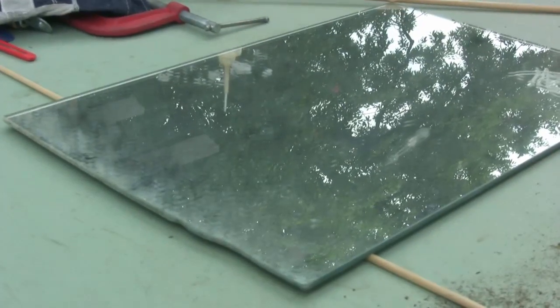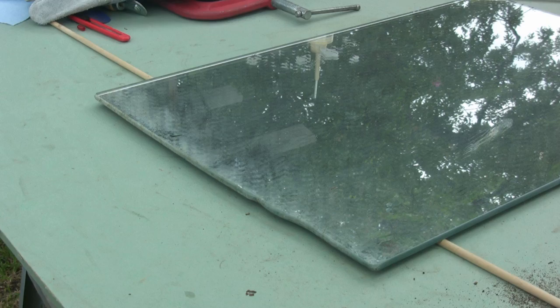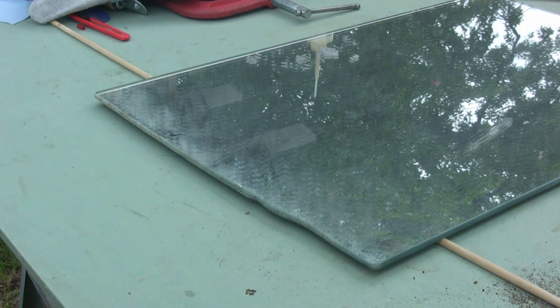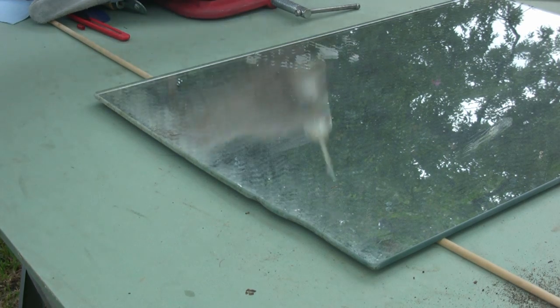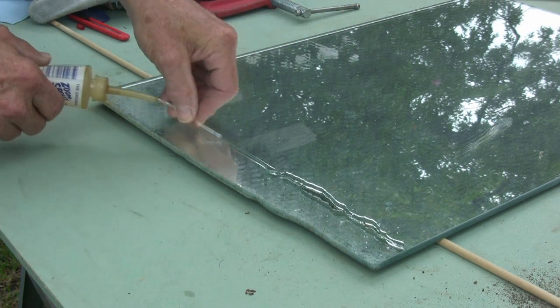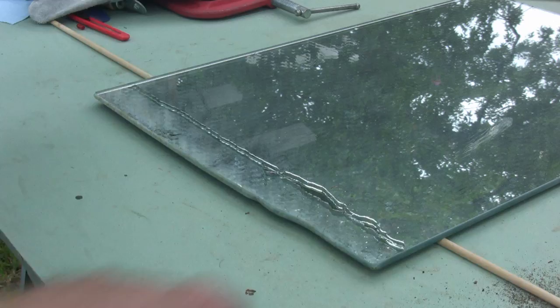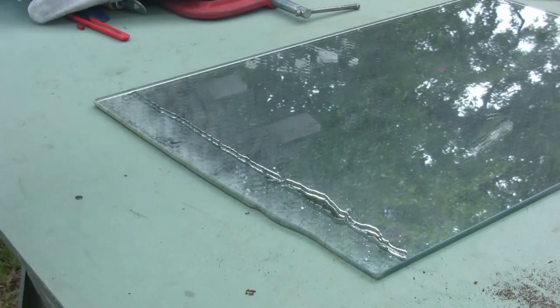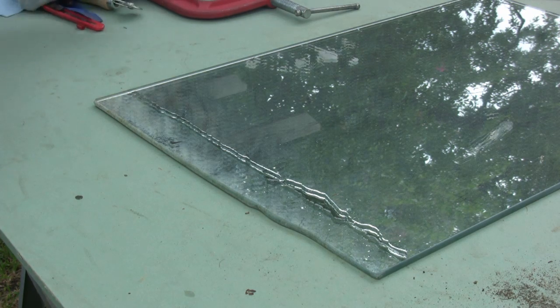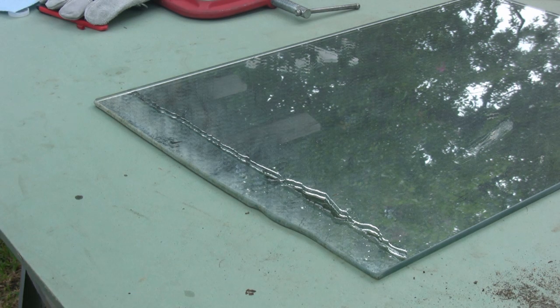My other mirror video got lost in cyberspace, so I'm going to recut it. I've got an imaginary line on there and I'm going to get my oil. This is a piece of quarter-inch glass. I've got my dowel rod — we don't want it under there yet. Now we're going to make our cut: try to carry a straight line, follow your mark, push down a little extra hard — harder than normal, but not too hard. About five or ten pounds of effort.